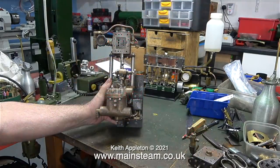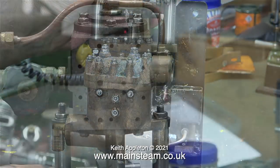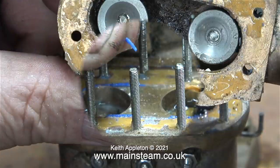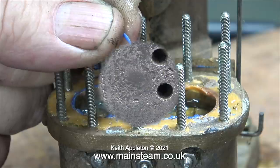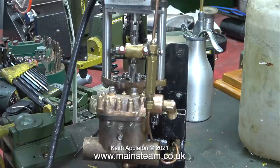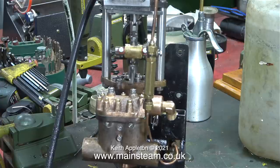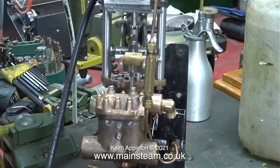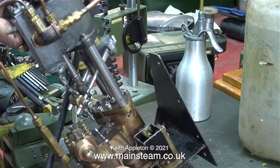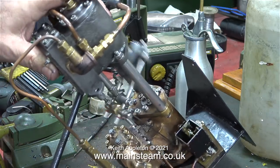Here's a quick deja vu sequence from when I first got the pump to show you what state it was in — it was pretty grim really; when I first looked at it I think I shuddered. It's taken quite a bit longer than I thought to make it run properly. Removing silicone rubber took long enough, then I had to deal with the mess by remachining the port face. In the end the repair is successful and the pump runs quite well. The problem now is the pump is designed to be fitted to a vertical flat surface, and I soon got fed up of holding it upright, so I decided to lay it on its side.